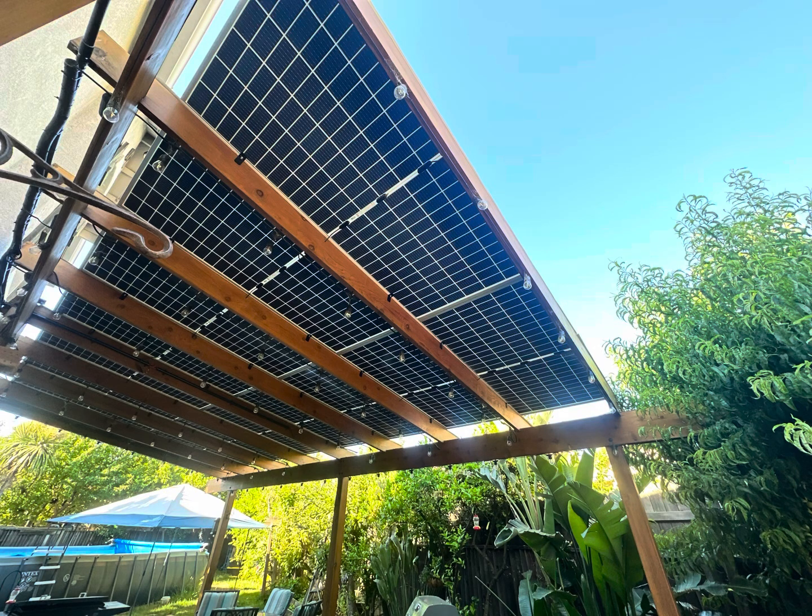What I've got here is a 6,400 watt array — 16 400-watt panels — and I'm going to upgrade it to an 8,000 watt array by adding two panels on each end. In order to do that I've got to access that 2x12 that's being blocked by that tree, so we're going to cut down that tree to get access to that 2x12 sticking out about two feet on each end. After that we're going to get a 2x8, run it from the 2x12s, and that's going to be our beam that holds up the panels.